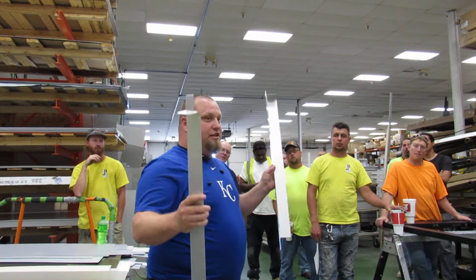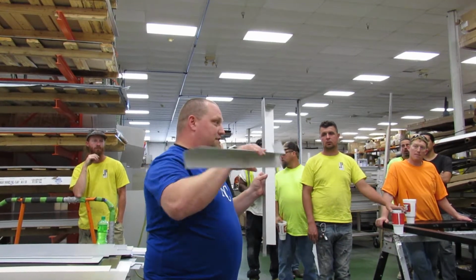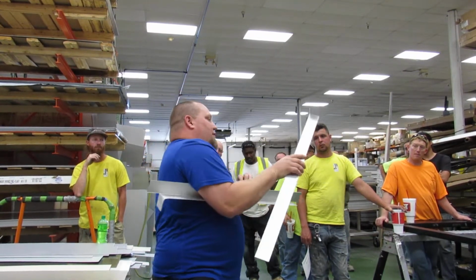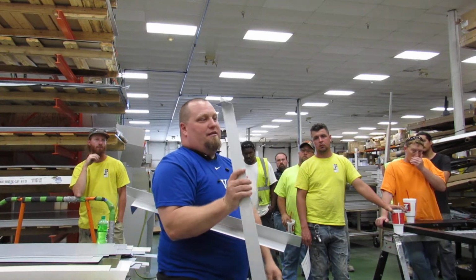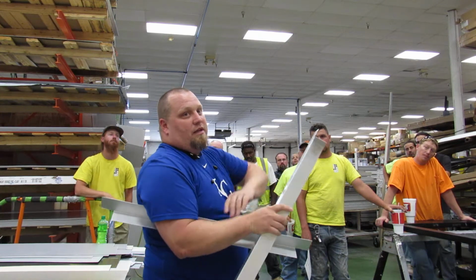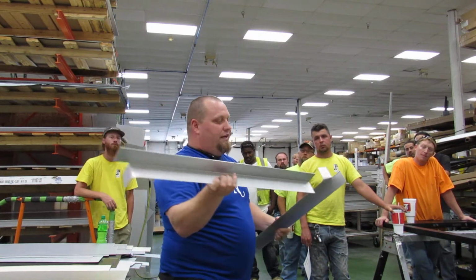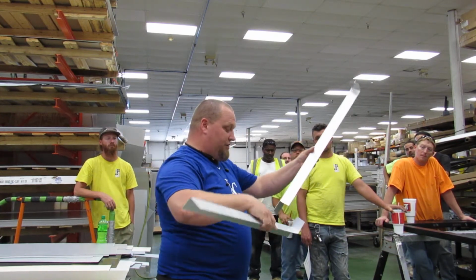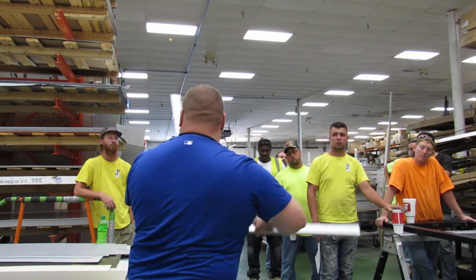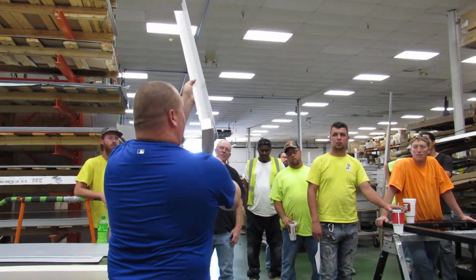you're always starting with the sill first, okay? Sill always has to go in first. You turn the leg up. And if you're wrapping it with an L angle, you have to cut it with your tabs like this. You have to have this lap. And the reason for that is you don't want a butt joint without it. When you have the lap, you have the shingle effect on this.